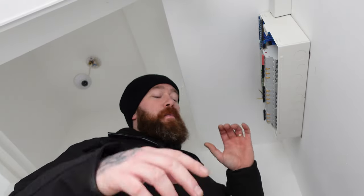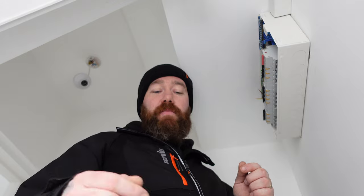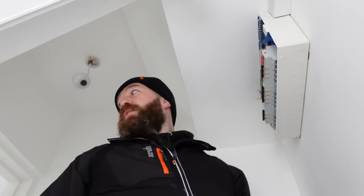When we do the R1, R2, this also tests for polarity. So because I've only got the live and the earth conductor plugged in on the tester, when I'm testing it, it's testing through those. You could test between the neutral and earth also and go around and take a reading as well. This would also definitely confirm polarity. You probably are meant to do that, but you know, we pick up shortcuts and things like that as we go, which is bad. But we move.